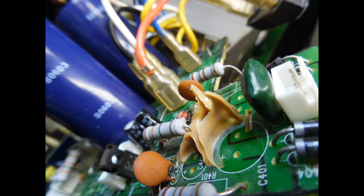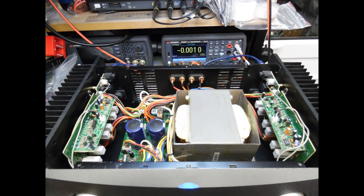The way to test it before removing the board is to verify the protection circuit isn't being triggered by an issue from the left or right channel power modules. Just unplug them — both the power and the multi-pin sensing connector. If you power up the amplifier and the relay changes over, then you know you have an issue with one of those power output modules, and you just connect one at a time to identify which is triggering. When I disconnected them and powered it up, the relay still didn't change over, confirming a high probability of the relay being the issue.